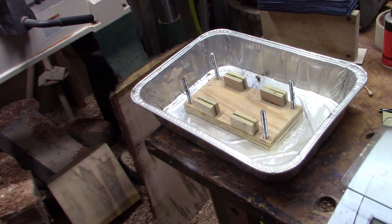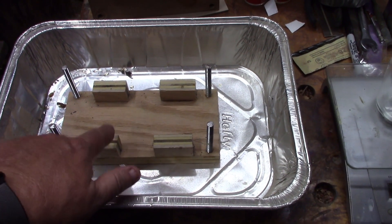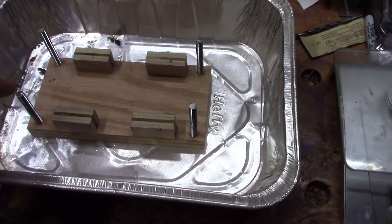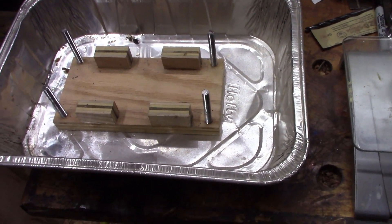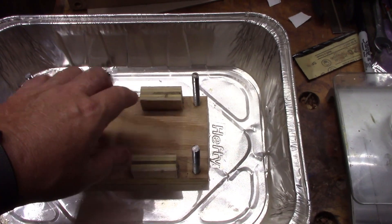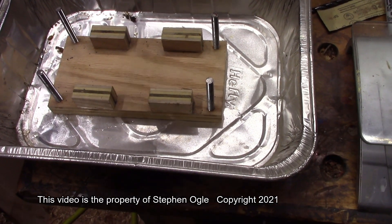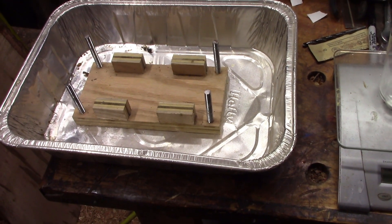The materials I need: first of all, I need some type of press. I've got this here — just a piece of plywood with four pieces of all-thread, I believe it's three-eighths inch, coming through on each corner. I made these spacers so that I don't have to worry about tightening down too much on one side and getting my micarta all out of whack. When I tighten all the bolts down onto these spacers, it's the correct height all the way. I'm going with seven-eighths inch, so if I need to, I can run my table saw right down the middle and still end up with two three-eighths inch thick scales. That's my press.